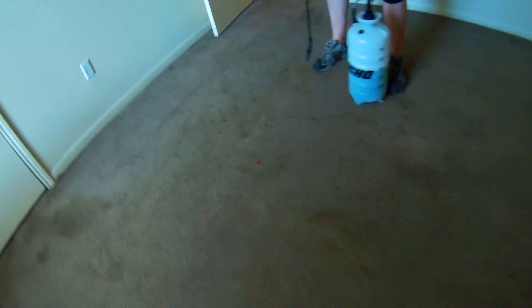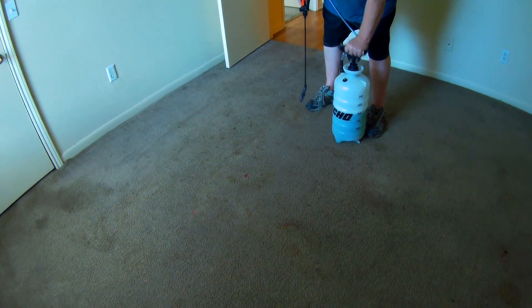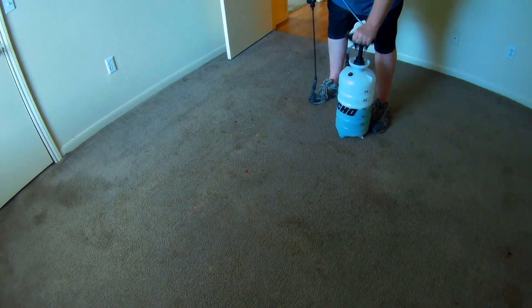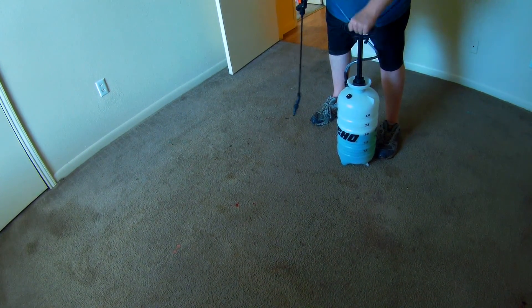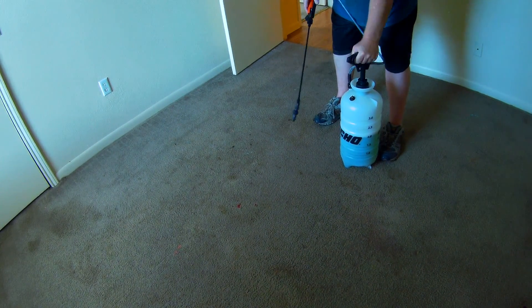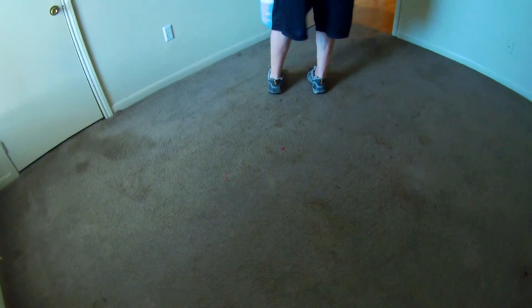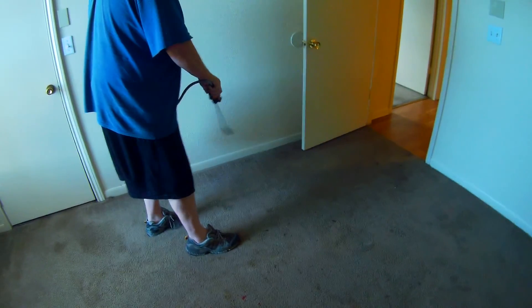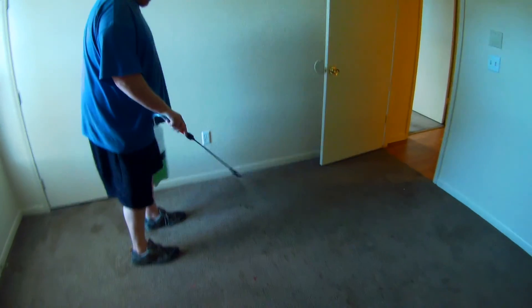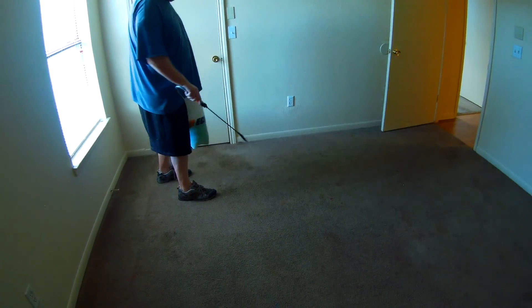It's amazing how much it holds because I hate pumping sprayers. You've got to pump it about 65 times to fill it up. I put two gallons in it, and then I've got an extra gallon of air I can put in there, and it'll spray and spray and spray. On a heavy carpet — like three bedrooms and a living room — I'll fill it up with three gallons and have to pump it more. But on one or two bedrooms with a living room, I'll put two gallons in, pump it about 65 times, and I won't pump it again the rest of the job.